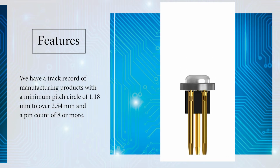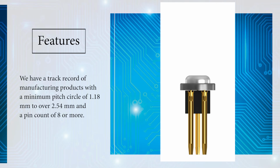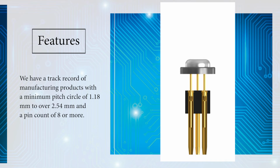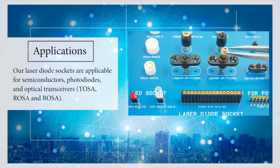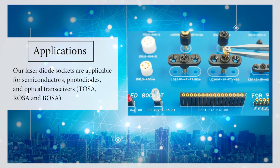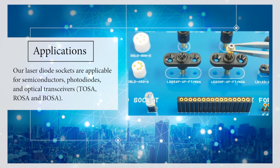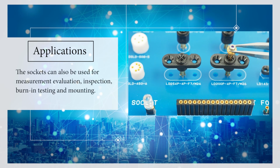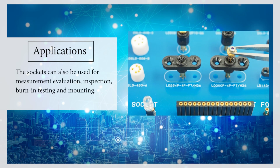We have a track record of manufacturing products with a minimum pitch circle of 1.18 millimeters to over 2.54 millimeters and a pin count of 8 or more. Our laser diode sockets are applicable for semiconductors, photodiodes, and optical transceivers, TOSA, ROSA, and BOSA. The sockets can also be used for measurement evaluation, inspection, burn-in testing, and mounting.